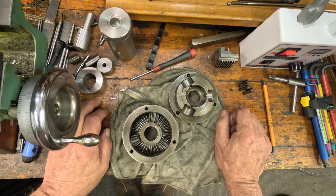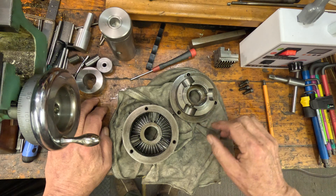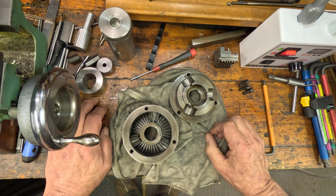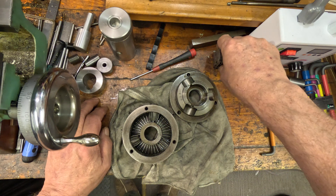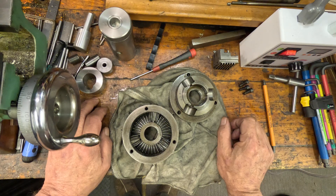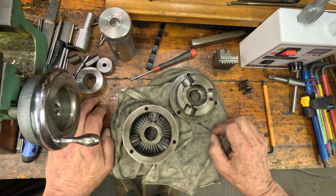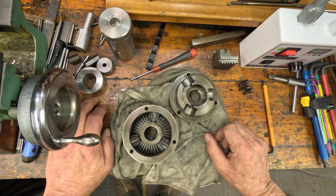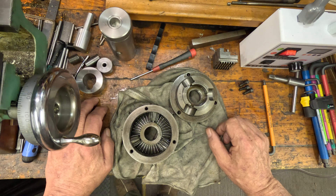That's how I've been using it for years. Anyway, I decided I'd try to re-grind the outside jaws. I had tried in the past and failed to re-grind them off the chuck because I didn't have a method of grinding the chuck jaws on the lathe. I figured the adjustment — the Griptru mechanism — would be able to get some concentricity. No, that didn't work out.